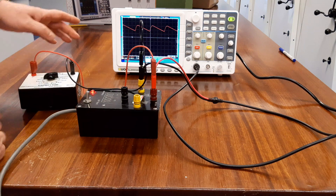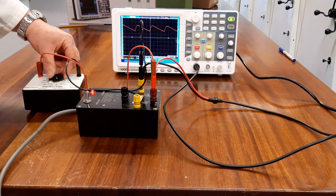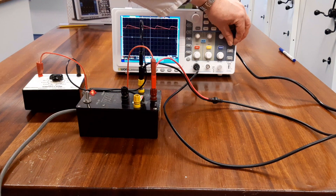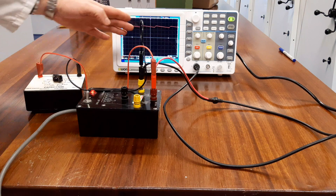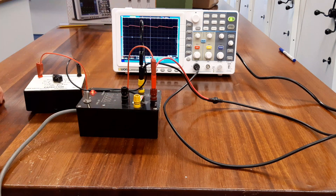As you can see, the capacitor is used to smooth out the waveform. Increasing it again and lifting the trigger point up higher, you're getting virtually a pure DC signal with only a little bit of ripple at the top.